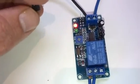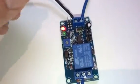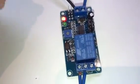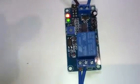You'd really need to buy strap cables to plug onto these pins. Then, whenever that circuit is joined, it does the switching. I'll show you now — when I put this strap on, you can see the green light come on. So the green light coming on means the relay has switched from one pole to the other.